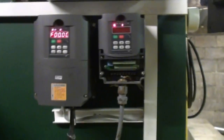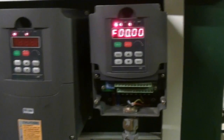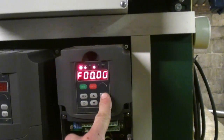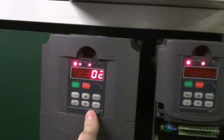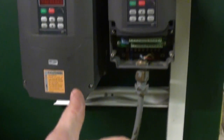For now I've just set each one up. There are about 200-something configuration settings on these units. They are Chinese so you do have to sort of teach yourself — the manual is somewhat right and somewhat utter rubbish. They are fairly simple to operate though. You just keep tapping the program button which will take you into the parameters. For example we're on 143 there. If I press set, it tells you this is a two-pole motor — that was set to four-pole. You need to set some basic stuff up like that if it's going to work. I've basically set these now with a max frequency of 50 hertz, which is standard.